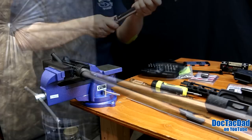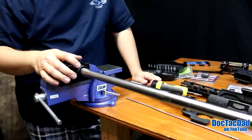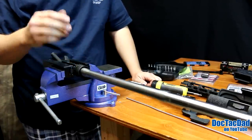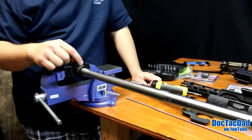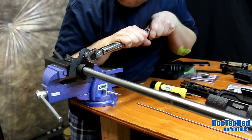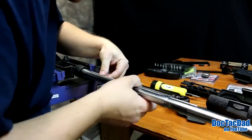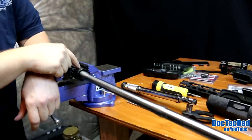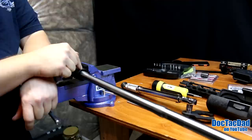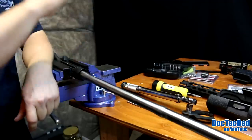So we're going to go up to 60. We've already gone up to 60 and the barrel nut is not aligning, so we're going to go up to 70. You can really go up to 80, so if it goes up to 80 and it's still not aligned, I might have to shim the barrel nut. I went back off camera, loosened it back up, and re-tightened it, and I actually got it to line up with just over 75 foot-pounds of torque. It's absolutely perfectly aligned right now — the wiggle back and forth gives us equal play on either side. So there it is, mounted up and ready to go.